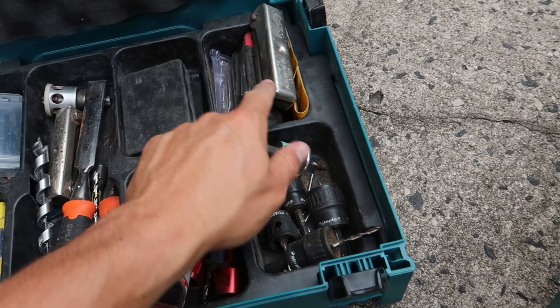I just bought a tough rule — I thought it was pretty cool and I might replace the four-fold with it. I've got a sliding square; these are really awesome, they always come in handy for scribing lines or measuring, I'll always have one in my nail bag. I've got a couple of packers I don't need, a pre-drill bit, a drill bit, and some spring punches that Fast Hinge sells. Then there's a 25 mil chisel that needs a sharpen — Barco is my favorite brand for chisels. I've also got some long punches: a fine one, one for NDs, and one for framing nails.